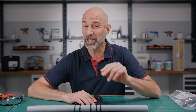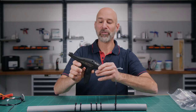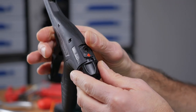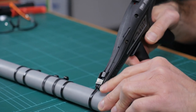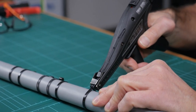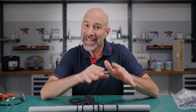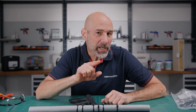To apply a cable tie quickly and cleanly with a cable tie gun, you only need to do three things. First you adjust the tension force — very easy. Then you position the gun just behind the head of the cable tie and then you tense and cut. Hardly any effort, precise and fast. And you get a clean cut.